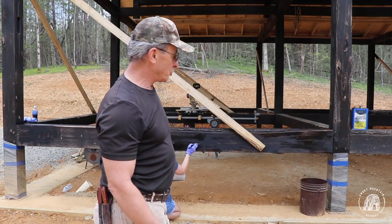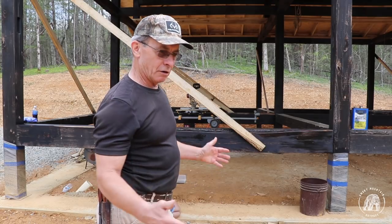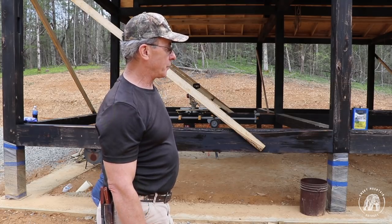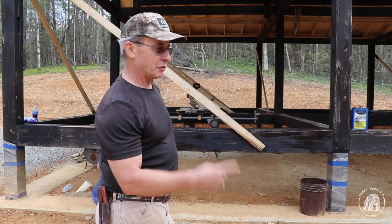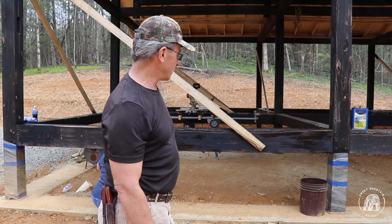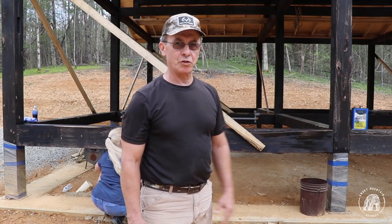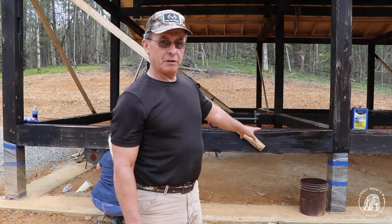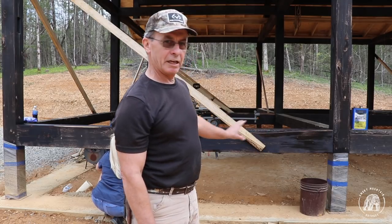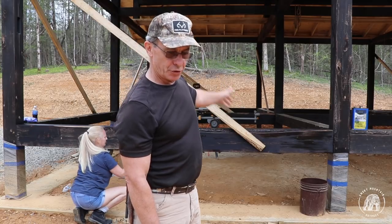The block will actually give me a small lip to set the floor joists on. I did check — a pallet, which is about waist high of rock, is $250. I think I can get by with about two pallets. I think that would look a whole lot better. So that will be coming up shortly, actually before I put my floor joists in. I will be laying block down here, and then I don't have to do the stone at that point, but it will give me a small ledge to put my floor joists on.